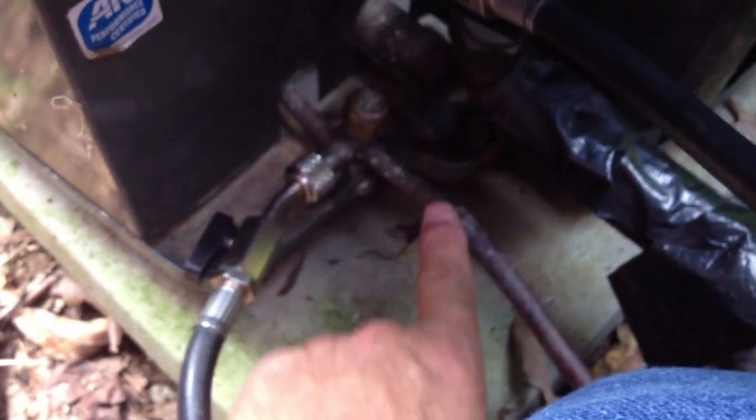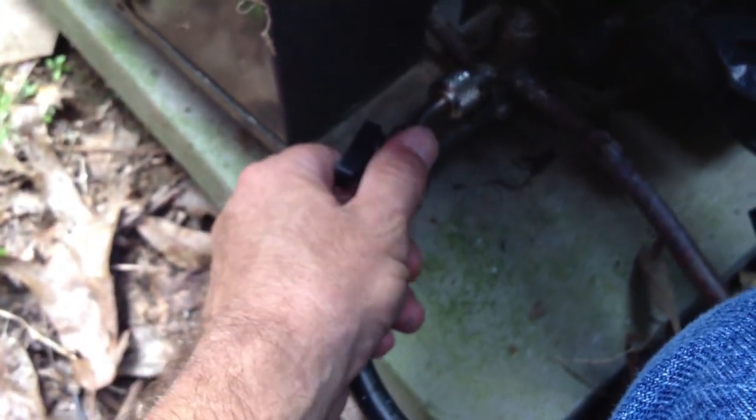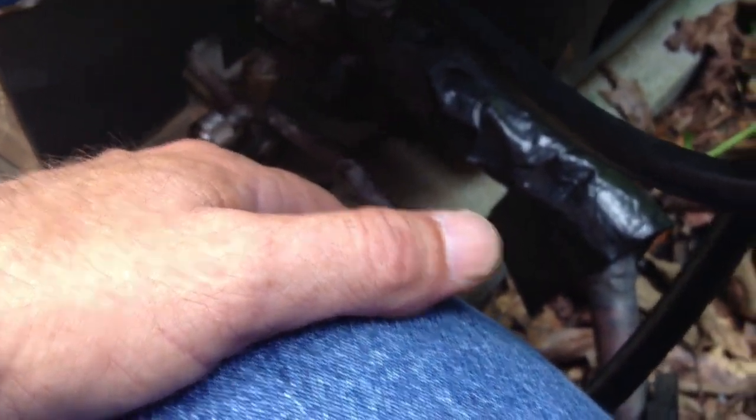There was no way I was going to cut all this stuff off, let it set for 24 hours, and go through all that just to find the leak. Because it is a heat pump, I was fortunate enough to be able to close everything off and then use one hose for my condenser for my outdoor unit and one hose for my line set coil. This line set goes from this unit, around, down on the ground, up through the hole, into the laundry room where the unit is.